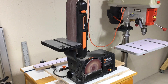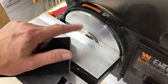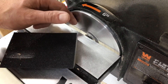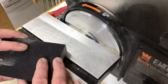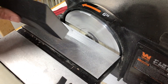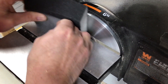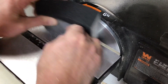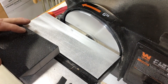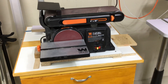Here's a tip for changing peel-and-stick sanding discs: if you don't change them often, especially if you're generating heat, the adhesive will stick to the aluminum platen. What I like to do is carefully peel off as much as I can, then use a foam sanding block — pick these up cheap, about 80-grit, from Home Depot or Harbor Freight — to clean up all the remaining adhesive. You have to get all of it off, because leftover adhesive just gets worse every time you change it. Clean it up properly and the next change will be much easier.